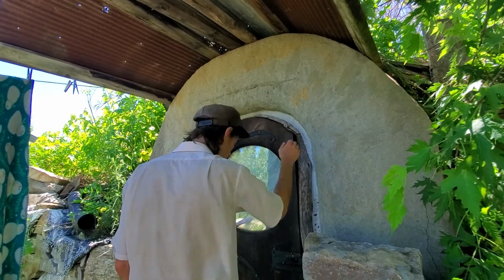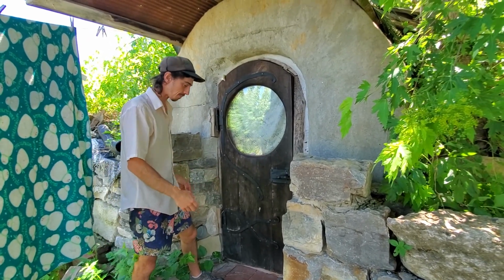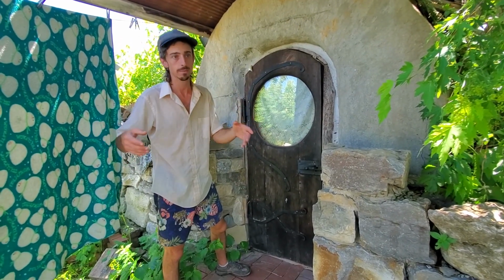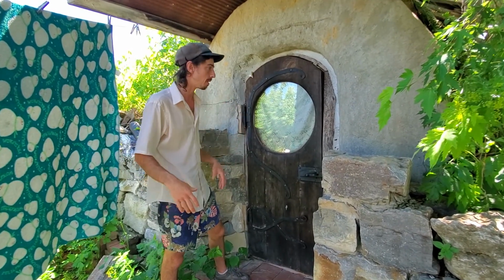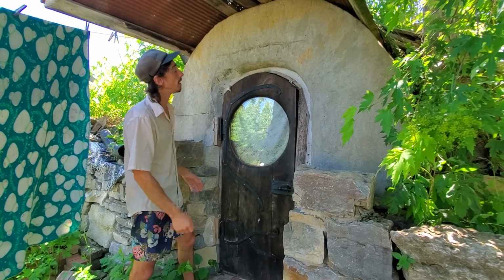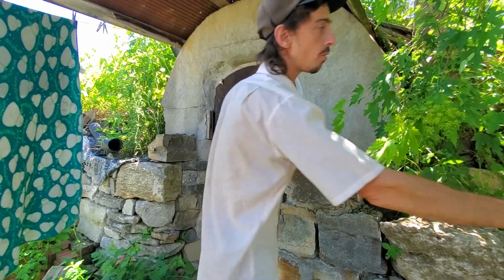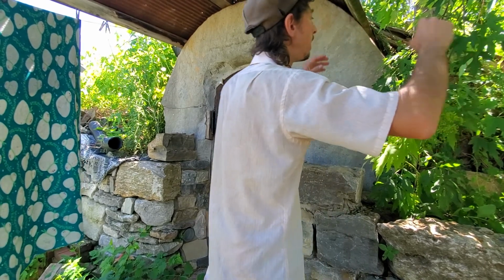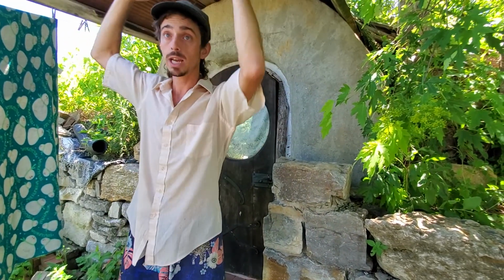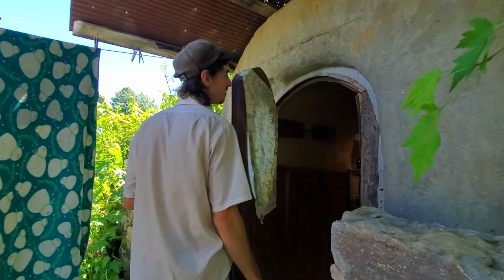So this was here when I came. The ground was up here, sort of level with the road, so I dug all this out with a backhoe. There's actually a lot of drainage under this gravel pad, but the idea is I have these big ideas about putting more buildings out here. I don't know if I'll get to that, but I was going to go up with stone, basically a stone facade that covers this, and eventually this will transition to cob, with stone corners and cob in here with some alcoves, and then a huge top plate and sill plate oak beam, and another building coming out from this. So this is another breezeway space. We'll see when that happens, but in the meantime, here we are.